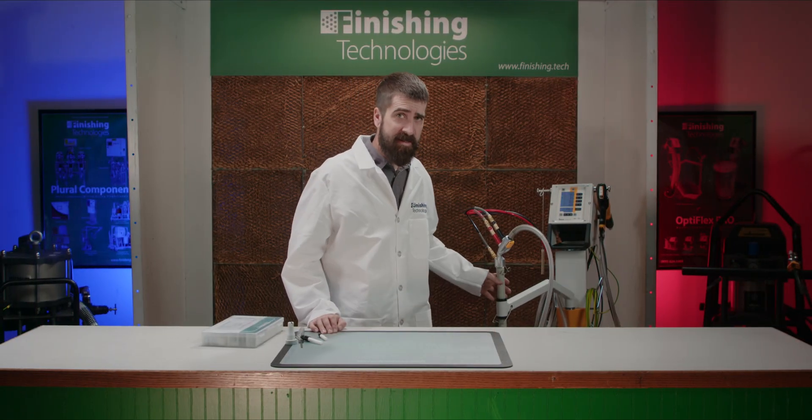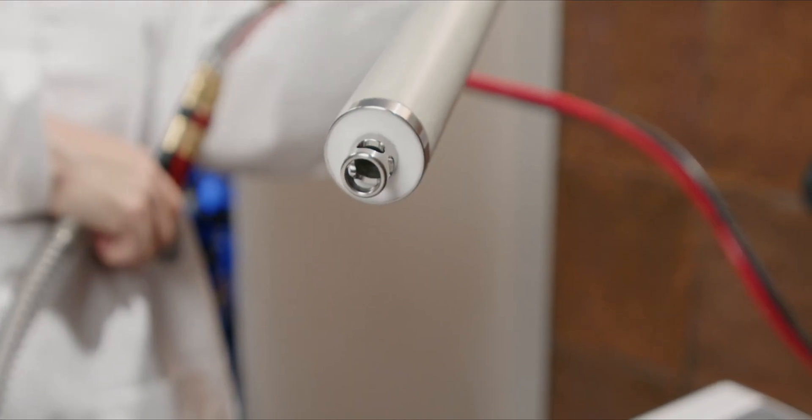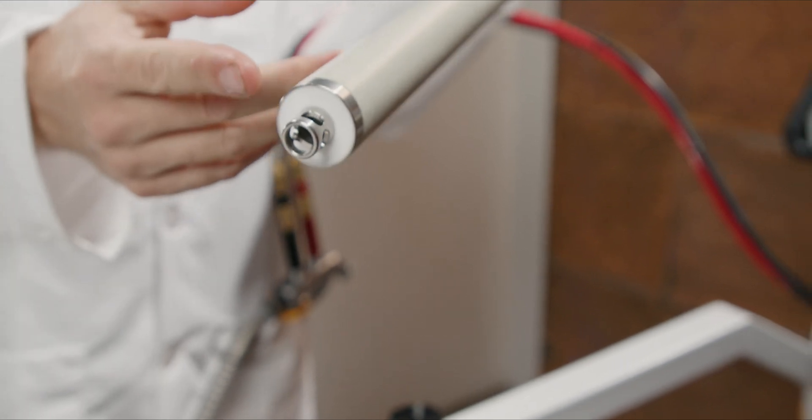Here at the bottom of the powder intake tube is the unit's fluidizing ring. We recommend preventatively replacing this twice a year. This fluidizing ring will experience reduced performance over time as powder embeds itself into the face of the ring. Depending on inbound air quality, this element can also see a slow reduction in performance as it loads with airborne moisture and oils.